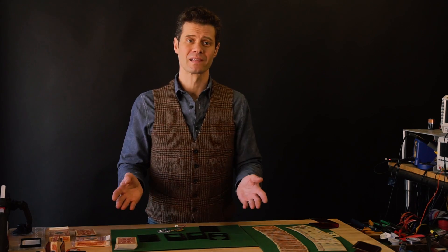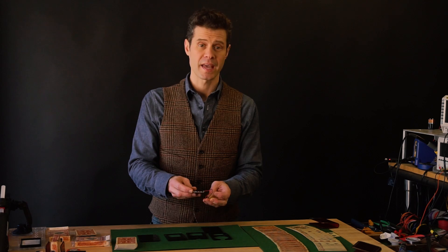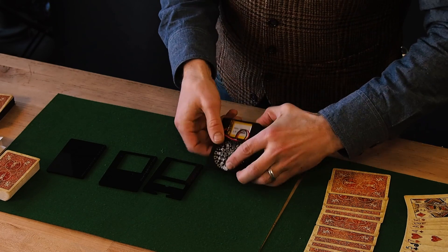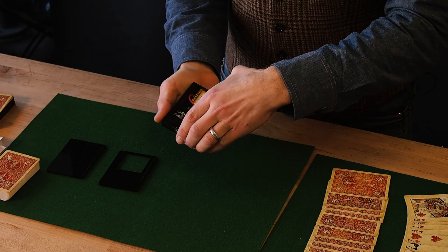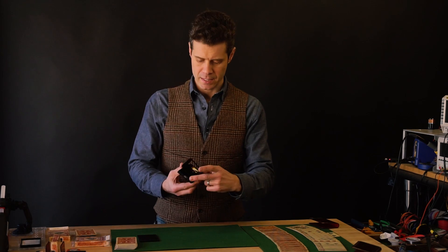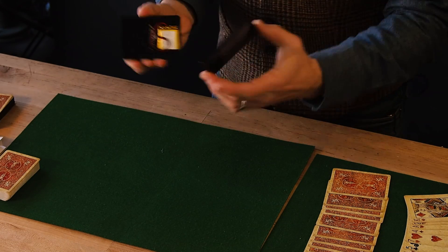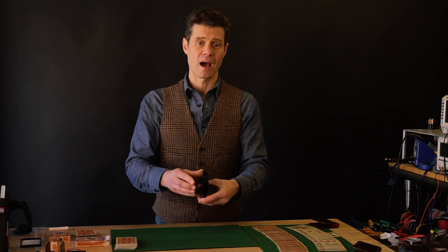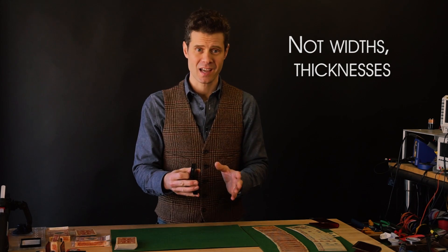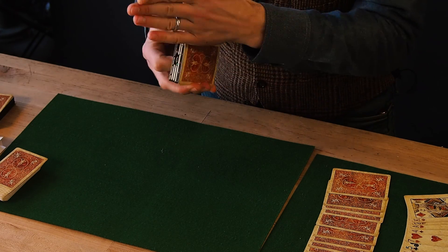Here's how I assembled the final layers of acrylic. I have a base, then I plug in the Circuit Playground and battery and fit them into the little cutouts. Then I have another layer to place on top that still leaves room for plugging in the USB in case you need to change the software. My next piece has a cutout for the speaker to help the sound get out — we didn't want to muffle it too much. Finally I cap it all off. This comes to within about eight to ten card widths of the exact size, so I grabbed a few cards and placed them on the top and bottom until I had an exact measurement.